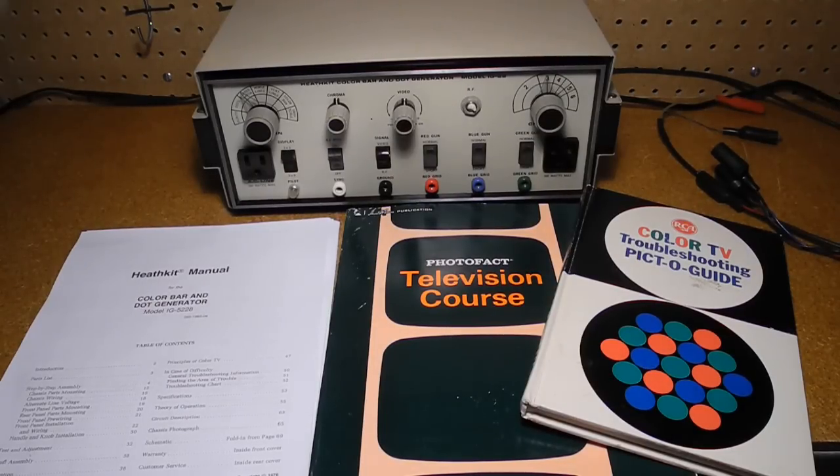Back in the days of CRT-based color television, adjustments such as convergence were relatively complex and required an instrument such as the IG-28 to perform. Along with a marker sweep generator, this is one of the specialized instruments needed for color television repair. This type of equipment is now obsolete — modern TVs typically no longer require alignment, the circuitry being fixed or aligning itself. Furthermore, analog television broadcasting using the NTSC standard has been phased out in most of North America and replaced by digital television, although most televisions still accept an analog input. Incidentally, if you need to generate test patterns to align an old television, a simple option is to use a DVD player and a test pattern DVD, examples of which can be found for free on the internet.